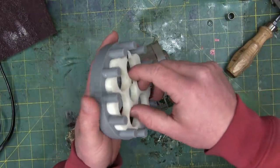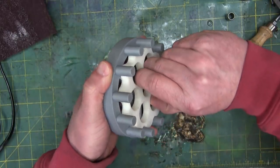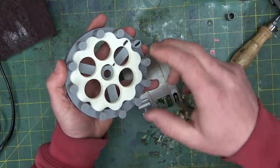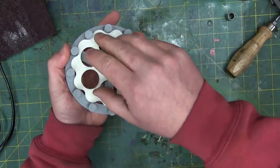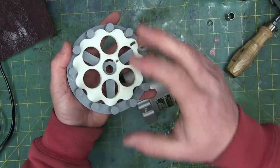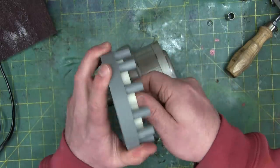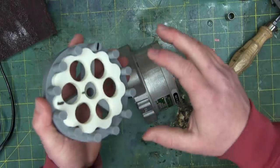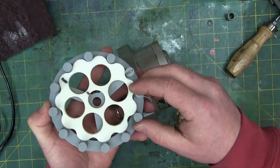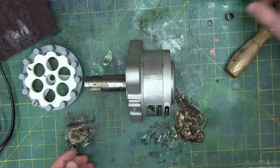You spin this thing fast and you induce a huge vibration. That is because this is offset — you have a big weight here that's turning and it's offset by this stroke of the cam. You do not want to induce any kind of mechanical vibration or oscillation into a rotating system — it's terrible, it'll tear itself apart. In order to overcome that, we have to mitigate it through some design feature. Let me prove it to you that we do.